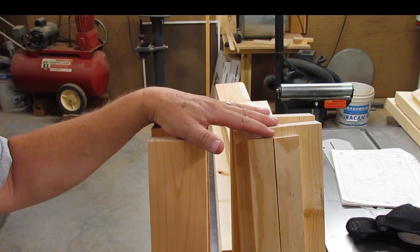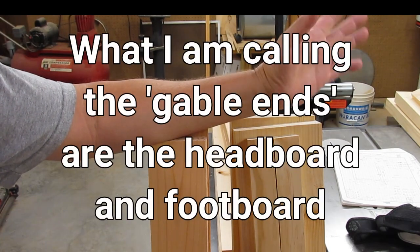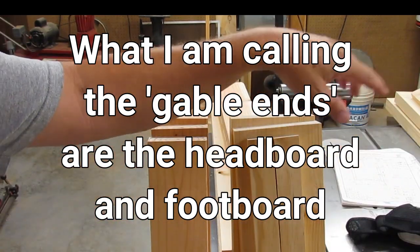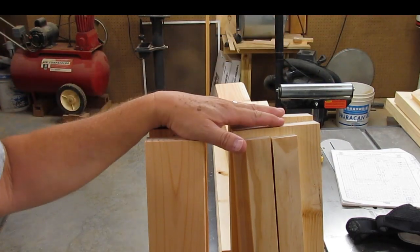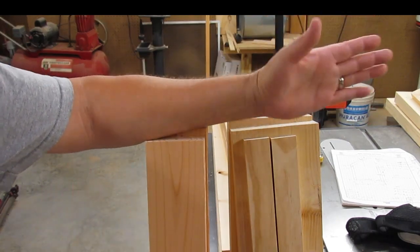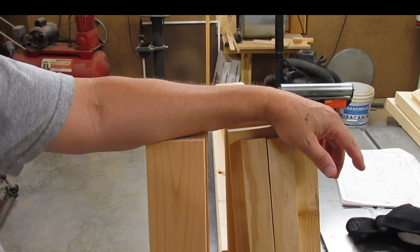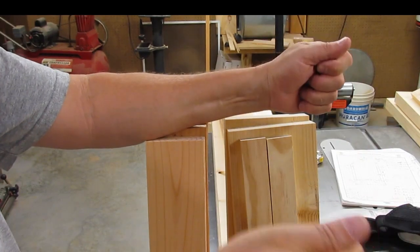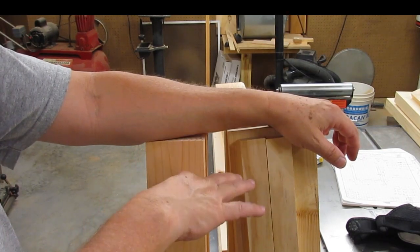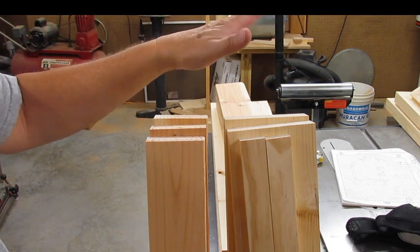All of these pieces are cut for the front and the back of the bed. What you'd call the gable ends of the house are going to be the ends, and the front and back are going to be open — though I'm going to put some railing around the bed to keep the baby from rolling out. These pieces are all cut to 52 inches because a standard toddler mattress in the U.S. is 52 inches long by 28 inches wide. The idea of a toddler bed is to take the crib mattress and allow the child to transition from the crib to the toddler bed.